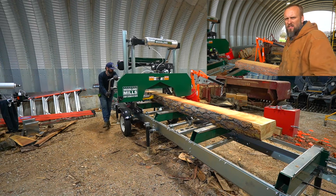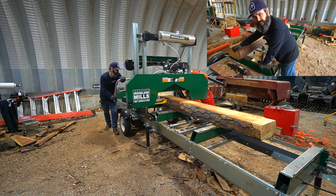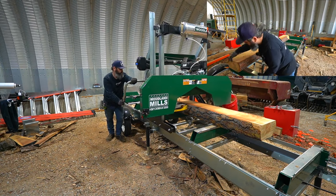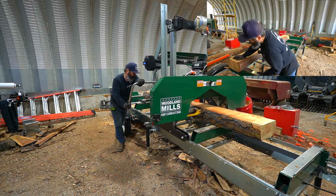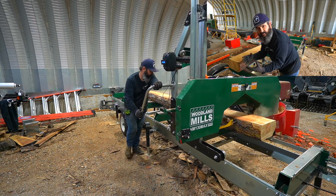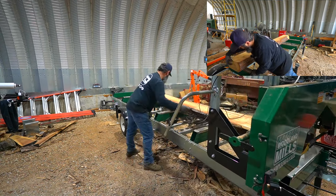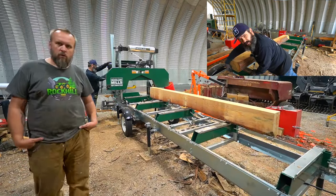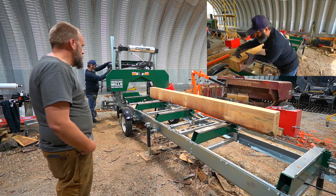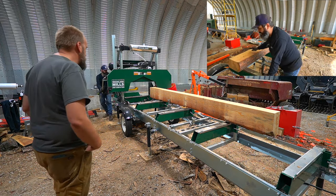Now, my understanding is softwood and hardwood are different in terms of the pith. If you notice, many of the 4x4s, 6x6s, and 8x8s, the pith is often centered right in those posts. The reason for that is they're using small diameter trees, and on softwoods you can do that. On this one, I'm a little bit off-centered. I'm gonna flip this and remove the remainder off this side, and it'll keep the pith a little bit more centered. That way you have all the forces equally around that middle, and this wood will not split. When these dry, they will get vertical cracking, but they won't break apart.